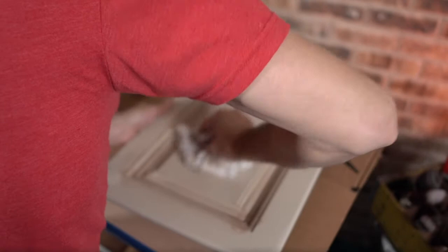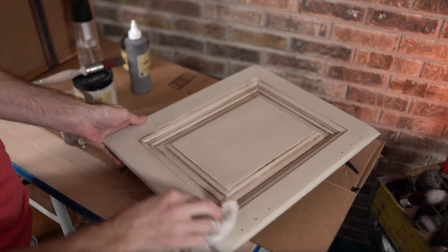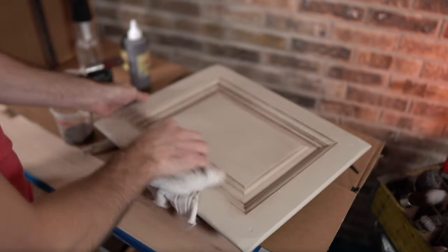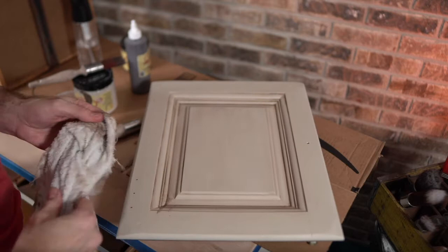And I'm taking the chance that I can do all this. In other words, I put all the VooDoo gel stain on at one time. If you want, practice doing one direction first before doing all four. But based on experience, I felt like I should have enough drying time to not have to do only one section at a time.